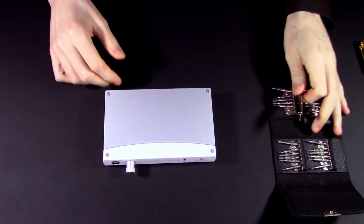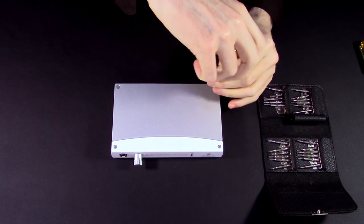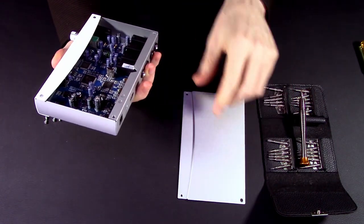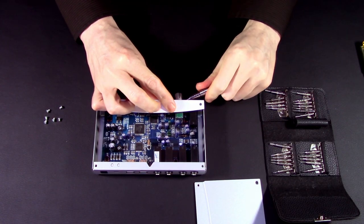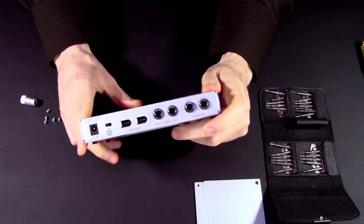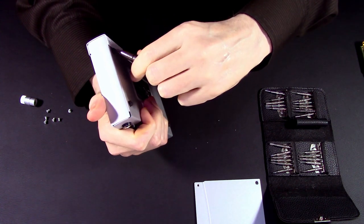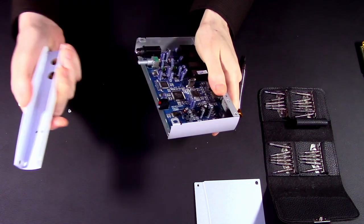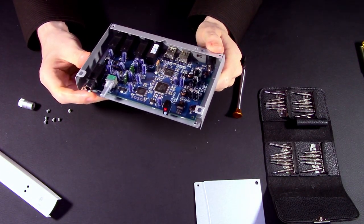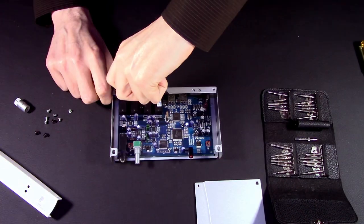Inspection and teardown time — let's rip it apart. There are four screws on the top and two on the bottom. The top just comes right off. We're going to have to get this front faceplate off, which requires some prying. This Behringer is surprisingly well-built, so I'm going to shove the screwdriver in and wiggle, wiggle, wiggle, wiggle. Pop — there we go. To truly free the circuit board, I need to get these four Phillips screws.